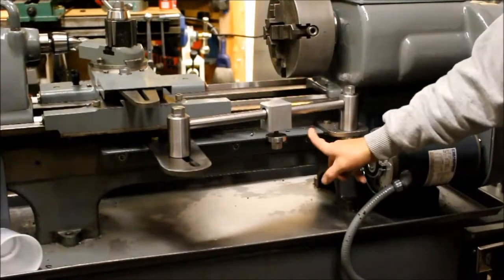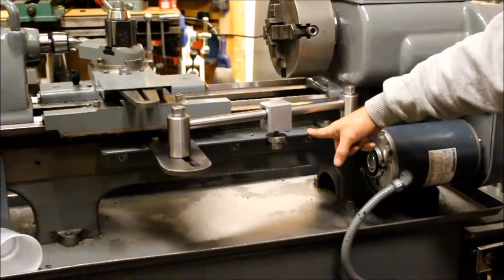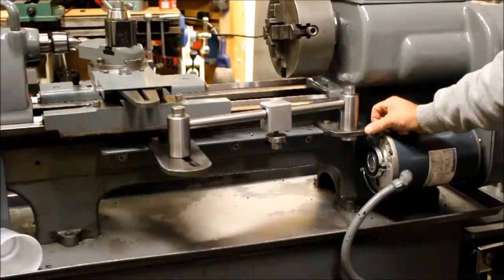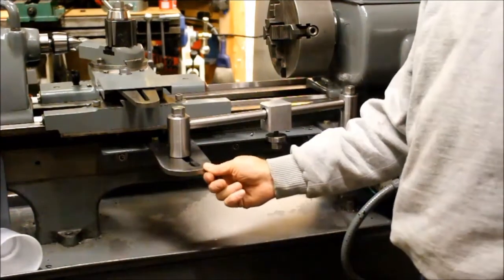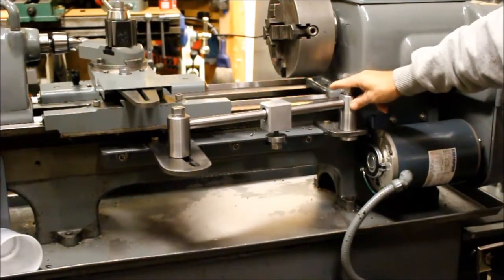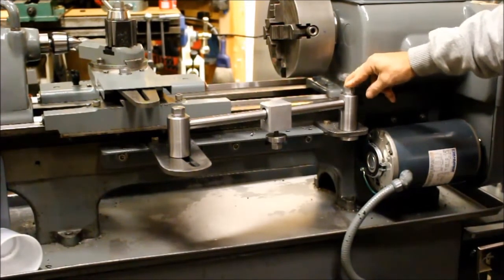This is a two-inch angle, quarter-inch thick. Quarter inch is fine — you could go thicker, but I wouldn't go any thinner. These are the arms that come out from it. They're three and a half and three-inch wide cold-rolled plate steel. They come out, in this case, around three and a half inches on this end, and probably around seven on the other. I have pillars — or support columns — that sit on these.